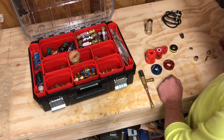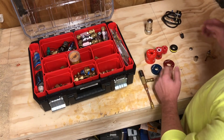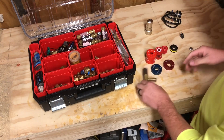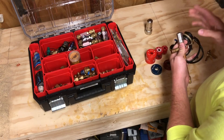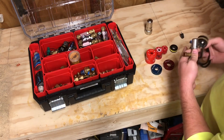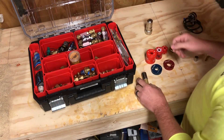Another thing worth noting is maintenance on these EEVs. Particularly when the EEV is in an outdoor unit, you're going to have rust buildup — it's going to happen. Whenever that rust builds up on the valve body and the coil, eventually the coil is not going to have the capacity to drive the EEV anymore, and then you're in a flood-back situation.